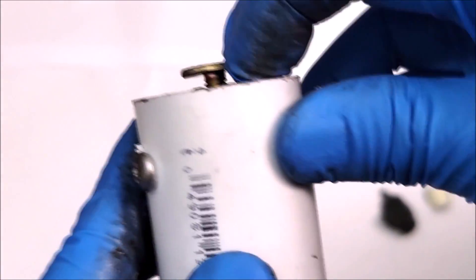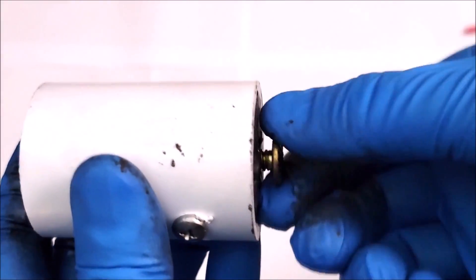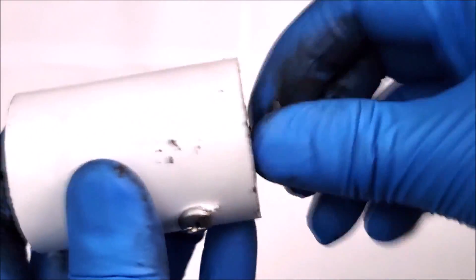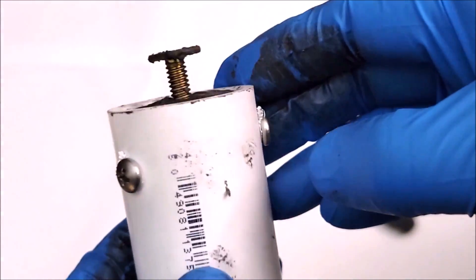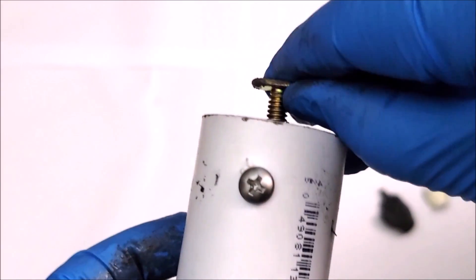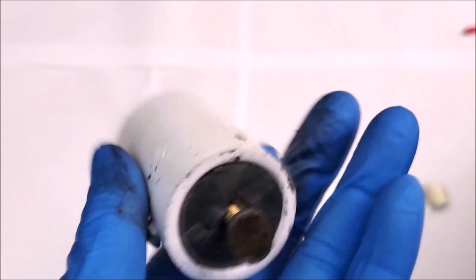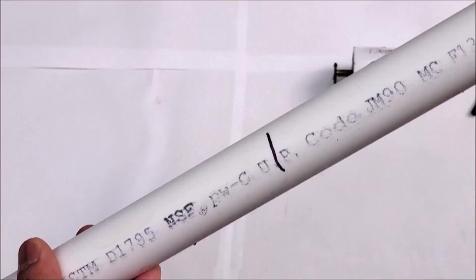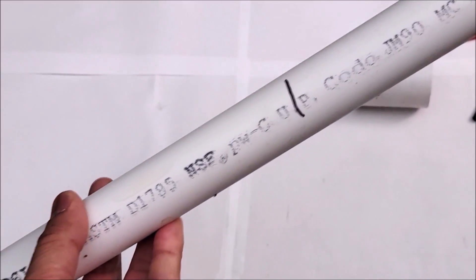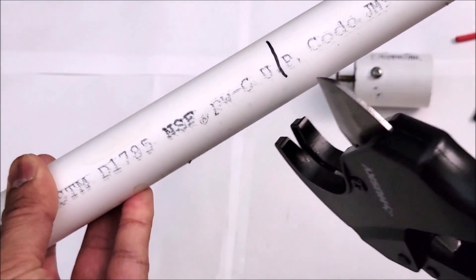It's pretty hard right now — I really can't mush it anymore. Twist that bolt to make sure it can turn; it can turn pretty well. That was roughly about five minutes and it's already hard — that's what we're looking for. We're going to leave it set for about 15 more minutes until it's fully hard, then move on to the next step. I'll use my PVC pipe here and cut it to 40 inches — I think that's plenty for my stern light.